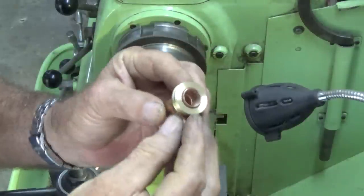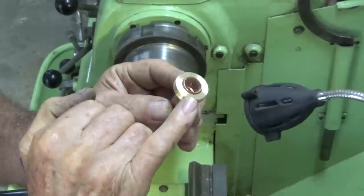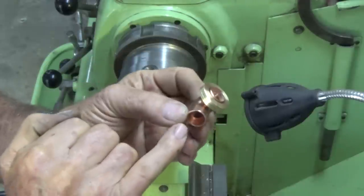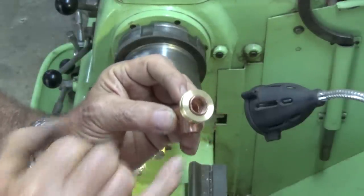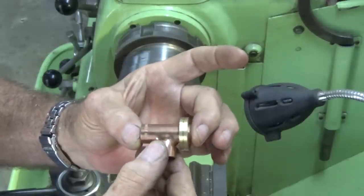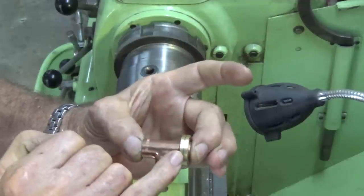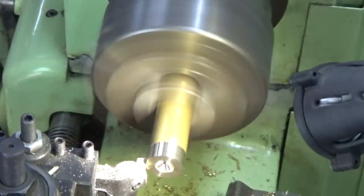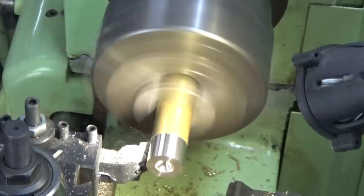I have to be able to make 12 of these fake pipe flanges, and they're going to be machined so they either fit over the outside of that T or over the outside of the copper pipe that fits into the T. Now I've got to do 12 because there's 3 for each one of these T's, and I've got 4 to do total. And I've set up my lathe. This one's just a prototype, but I used it to actually work out all my offsets and the depths of the chamfers and so on. I marked that up on the drawing, and I can go ahead and get these done very quickly.